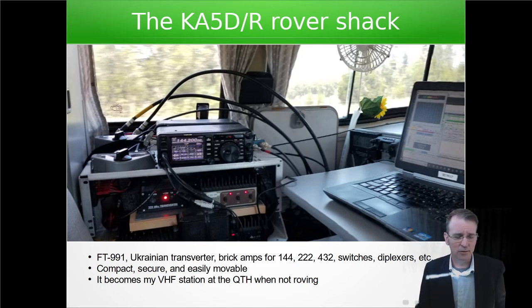This is compact and easily movable. We have everything in sort of a homebrew rack that, as we're bouncing down the road, nothing's going to shake loose. That's really important because a lot of times we're on gravel roads in rural areas, so you have to be prepared for that. Our antenna setups — you've got to make sure they're 13 and a half feet high or less when you're rolling. Otherwise you're going to hit bridges and trees, so safety is a concern there. Having a transverter is really important too. 222 is a great band — it's double the points of two meters per contact, so you ought to think seriously about getting one of those transverters.